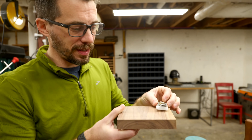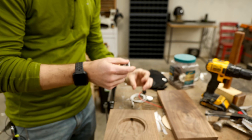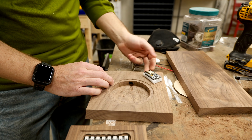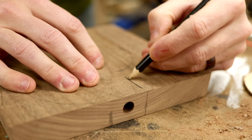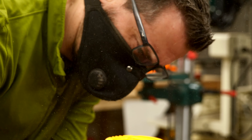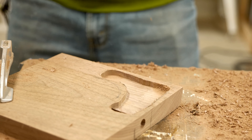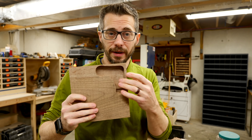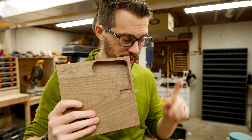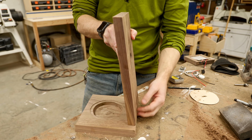I need a place to put this controller, and instead of mounting it up here on top where it's kind of ugly, I think I'm going to hide it down in the bottom. I'm going to run the wires from the lights all the way down, and on the underside of this bottom section I'm going to route out an area to embed this controller in, while still getting access to it from underneath in case I need to reprogram it. I also need to route another channel on the backside so we can run wires from the bottom to the top to connect all those components.